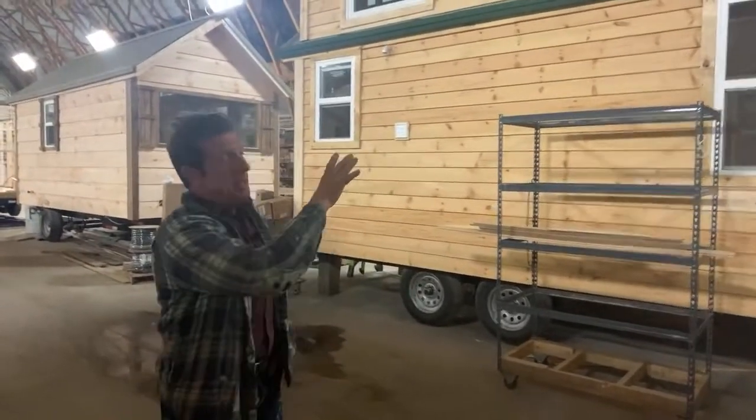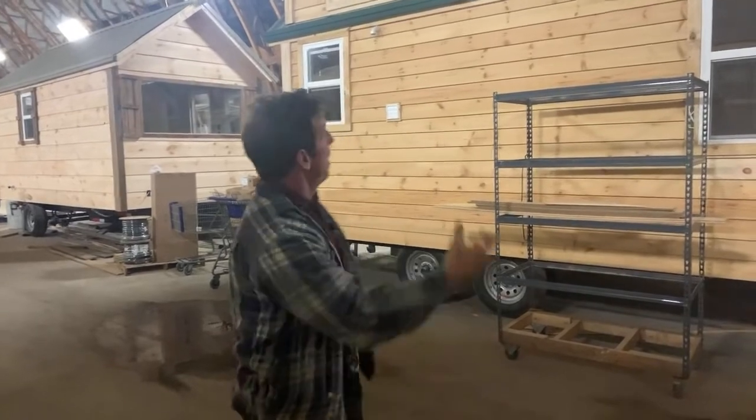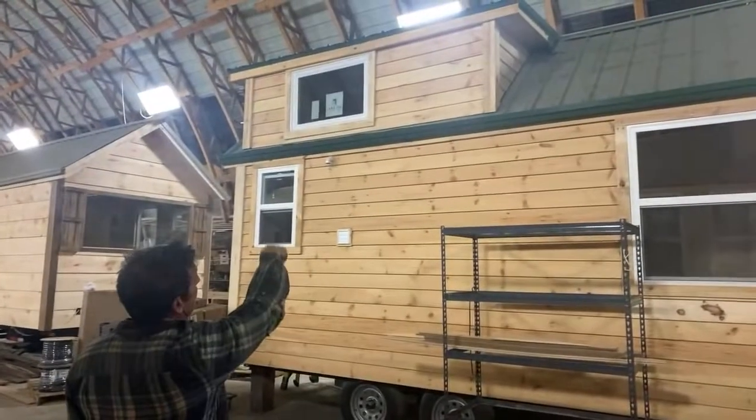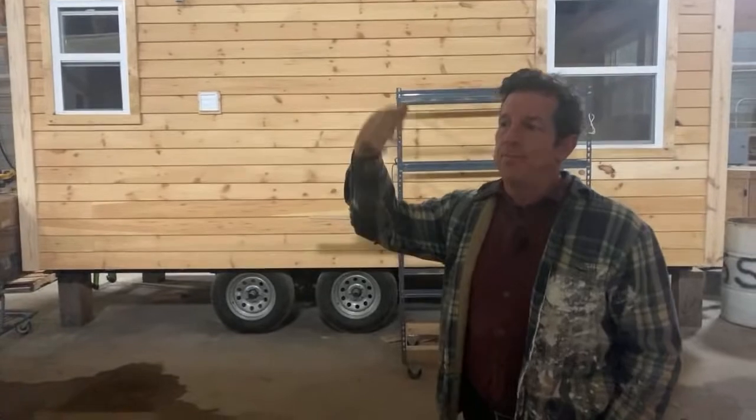Now, I don't eliminate the windows. I just go 160 square feet. So you go to each of the 4 walls. That's how much coverage you have. If you have a dormer, it's 10 foot by 3 foot, 30 more square feet, so you probably got about 60 square feet on a dormer. You may have 500 on the outside, 560 square feet I need to cover. Call Stucco Flex. This is how many square feet that I have to cover.